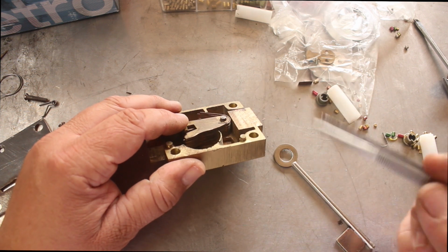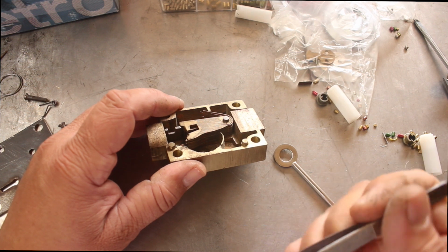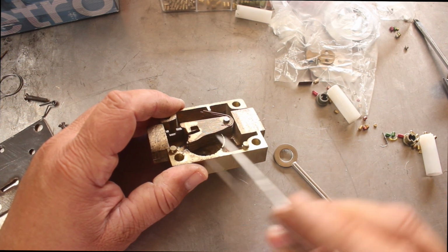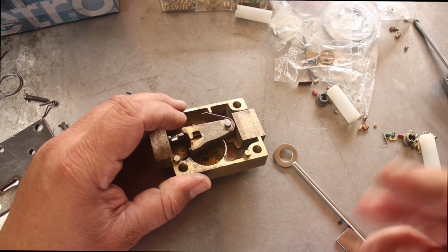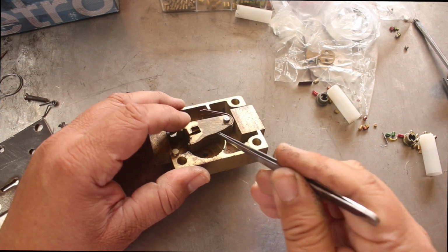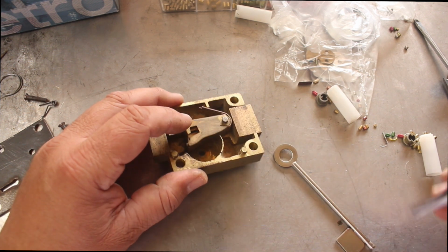You really have to be on the money for these levers, because some levers are higher, some are low, and it's a bit of a castle. So if you've seen the top of a castle where it goes up, down, like that, that's exactly the way the key should be. So if it's a low point, the lever will fall right into the low point, and if it's a high spot, it'll be on the high spot.